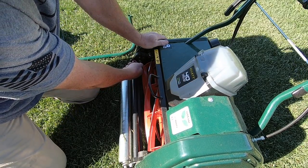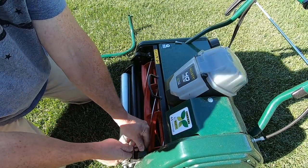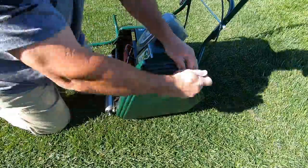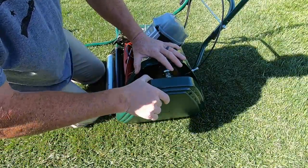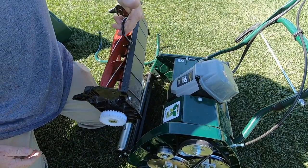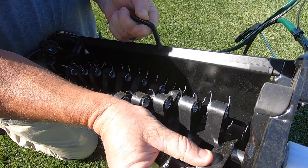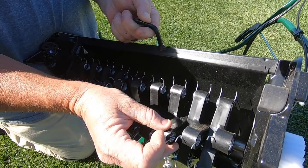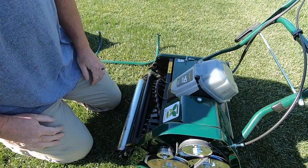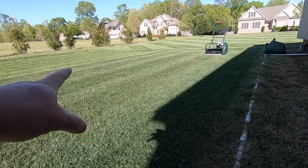Don't want to lose those bolts. Come over to the side and do the same thing. Here's the easy part — you just grab your reel and pull it right out. You can see the tines are kind of flimsy but just tough enough to do the job without tearing everything up. Then you drop the new cartridge in place, put the cover back on, put the two bolts back in, and you're ready to go.